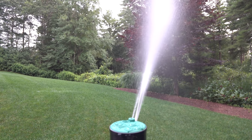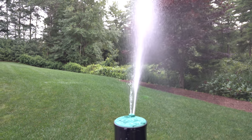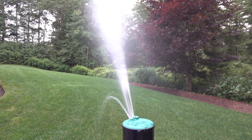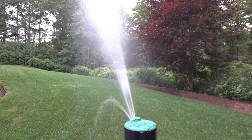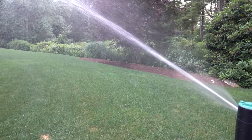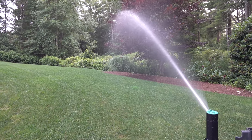Now you have the power to control your sprinklers right down to the finest detail. If your zones are causing brown grass, increase the nozzle to put down more water. If they're putting down too much, reduce it. And if you're shooting water in places you shouldn't, use that screw adjustment to control how far it'll go. I hope this video was helpful so you can control your sprinklers without paying somebody a lot of money. Please give me a thumbs up, subscribe, and comment below.